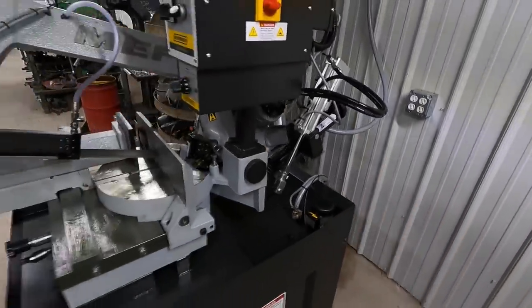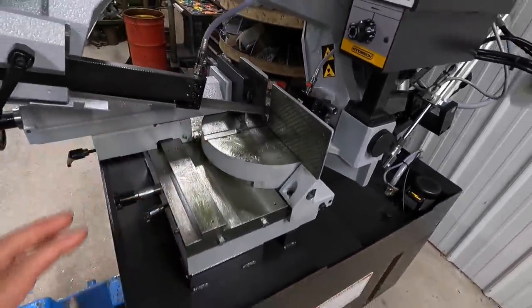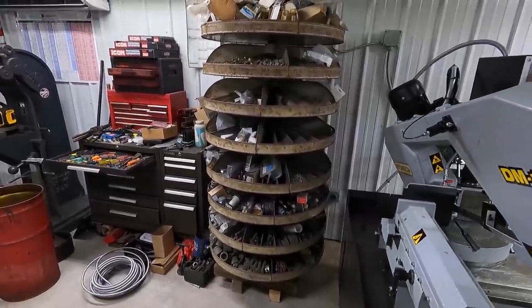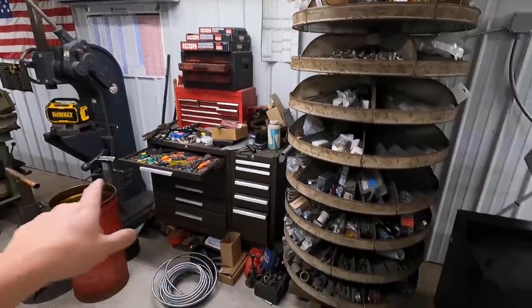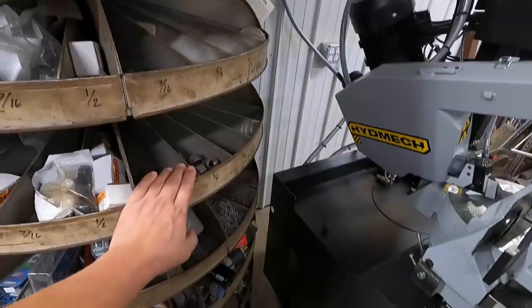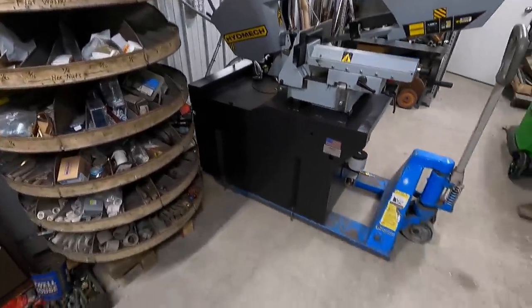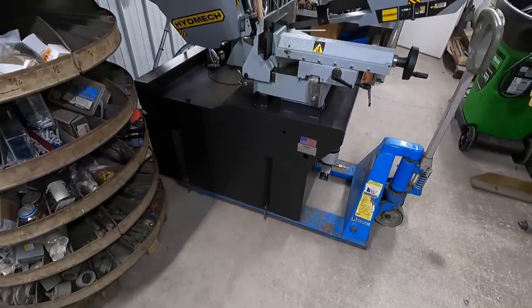I'll change that back to where I had it. From here, I'm just going to start getting the cosmoline cleaned off of it. This rotary bin — I wish I could get it to the garage, but I've got dirt out there and nowhere else to put it. I think I'll go ahead and take this rotary bin and my toolbox and just swap places. When I put this in place, opening the door to change the blade, this is going to be in the way. If I move this over there and the toolbox over, the toolbox will not be in the way of that guard. I've got it where I can pick it up with my pallet jack and quickly move it. I've also got to get the feet ordered — right now I've just got some 3/8 bolts in there holding it up, and I'm going to get some proper machinery feet for those as well.